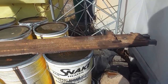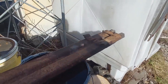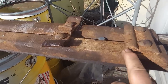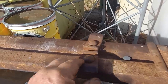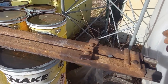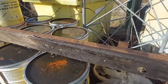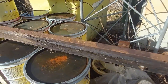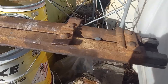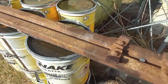This is what they use to lay the rail on underground. The base of the rail lays in here, and then these clips swing over — kind of like a Pandrol clip, sort of. This is the tie plate they use underground. It's been sitting out here for over a year — I've been wanting to make this video. That's how they fasten the rail down. It's all rusted up but you can see how they do it. This is just a little metal plate that lags into the tie.